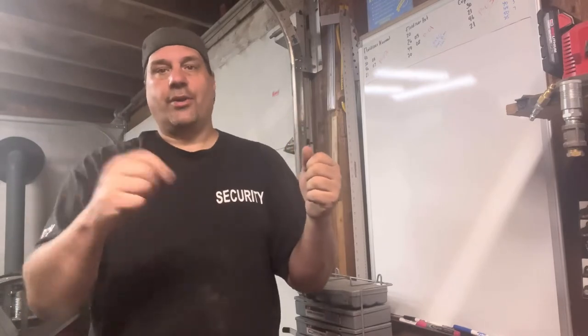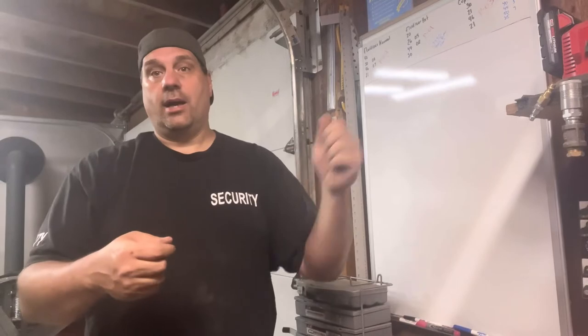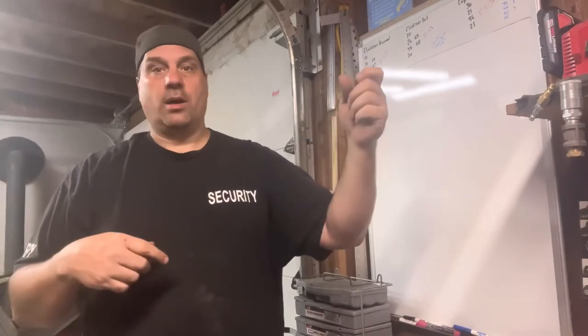So like I said, if you spray it, say you start on 30, okay, it's not attaching. I go to 40, not attaching. I go to 50, up, it's attaching. Okay, you're good. And trust me, you ain't gonna get that high with microamps. I should have used like 5, 10, and 15, but that's just an example. So if you can do it, at the low end of your microamps, you shouldn't have to deal with back ionization. So just go every 5 or whatever, up, nothing. 5 more, nothing. 5 more, nothing. 5 more, sticking. You're done.